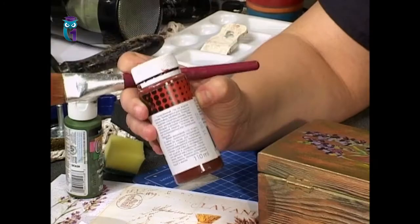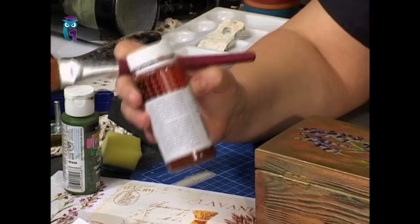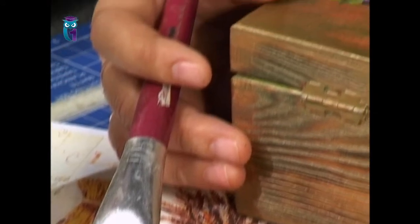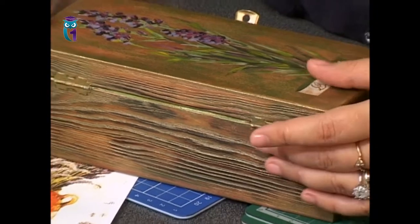For this project, I took color varnish. You can buy this solution ready prepared or create it independently, having tinted usual clear acrylic varnish with a pigment or acrylic paint in the color necessary to you. A surface toned and grounded in a similar way has a very beautiful appearance and, by the way, can be the only means with which you decide to decorate your product. It will look elegant and no other processing for wood is required.